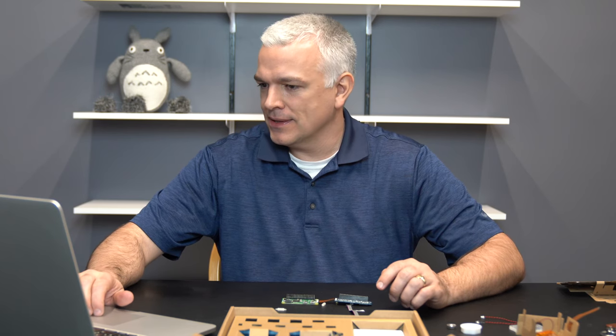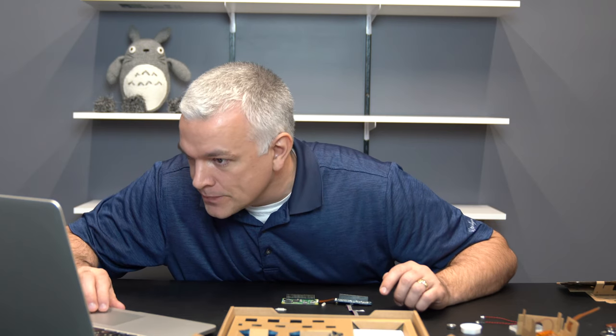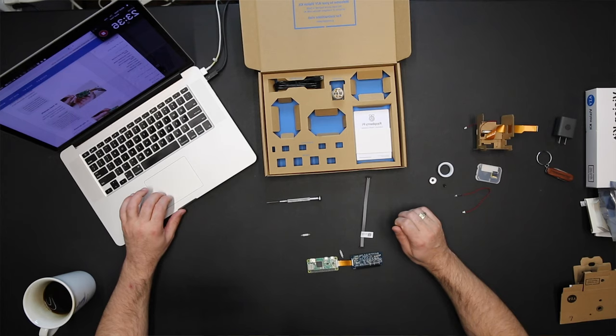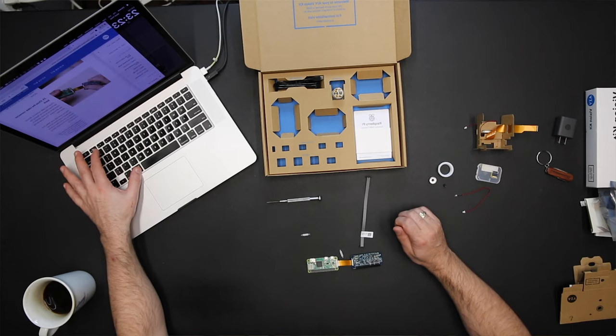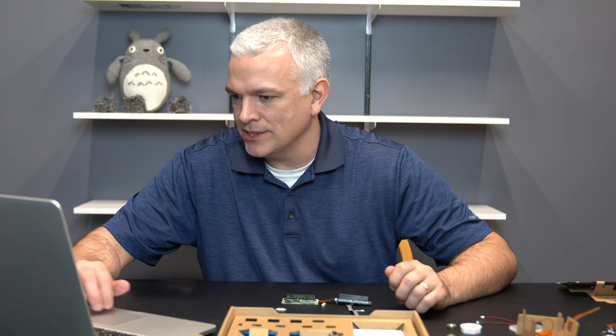Close the cable latch. Okay, the standoffs. Insert the standoffs into the Raspberry Pi board in the holes opposite the pin header. That's tough. So I'm gonna see if I can zoom in. Zoom, zoom, zoom, zoom. Okay, zoomed in, it offset the images, changed the position.